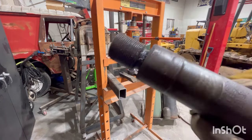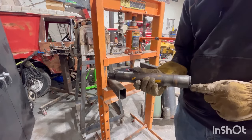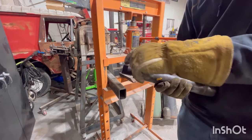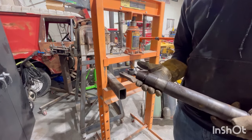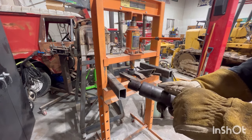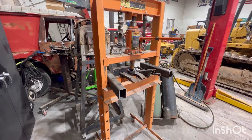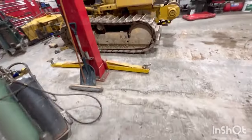At least it gives me an idea how much I need to build that stuff up. I was thinking about making a whole new pin but it's a goofy size - it's 1.990 inches. I guess I could get a two inch piece of stock, then I'd have to build the threads and this shelf on this end. I don't have any stock to do that, so I think I'm going to build this up all the way around and then just turn it back down - probably be the fastest. I'd have to wait and get a piece of stock tomorrow. I honestly don't know what you're supposed to make these out of either.